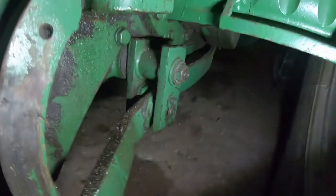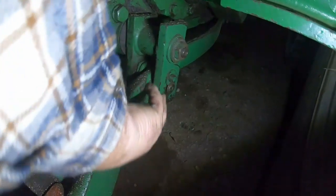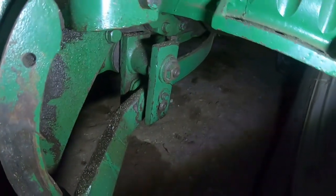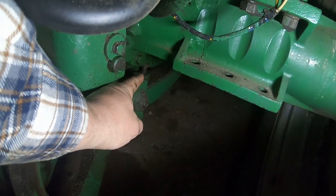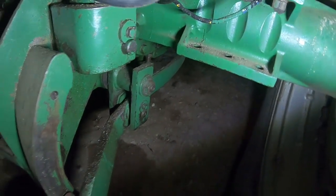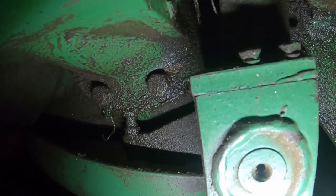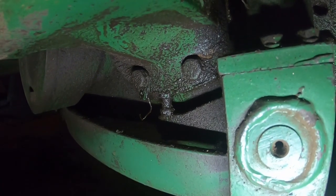Okay, right there. That's the nut you have to take off. And then this horseshoe yoke thing slides off from that assembly. But before you do, leaf springs are preloaded with pressure. That bolt right up there, you've got to loosen that up. And I believe there's one on the other side. Yeah, it comes out of the axle housing down onto it. Measure the length of those, because if you don't get them back with the right amount of preload, it affects how your 3-point hitch will work.